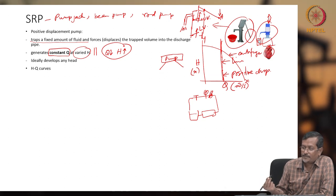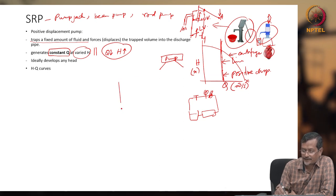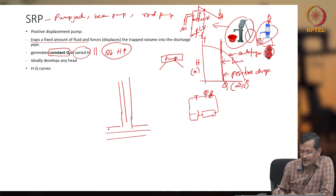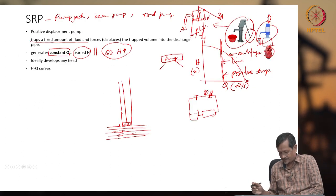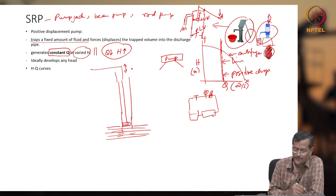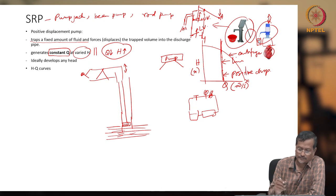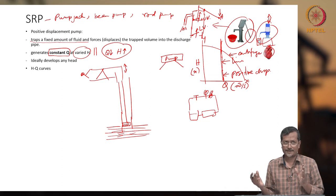Now, if we consider the sucker rod pump in a wellbore system, it will have a similar mechanism as the hand pump. It will have a wellbore, and one rod coming down to your reservoir area where reservoir fluid will be there. And you have one plunger piston, and from there one surface mechanism will be there. From the surface mechanism, you are giving the relative motion of this rod. So this will be the sucker rod pump mechanism. The sucker rod pump and hand pump, all these mechanisms are basically the same.